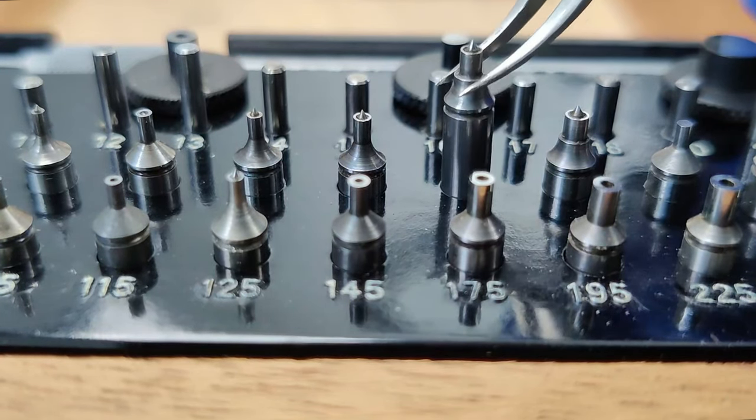Twisting the handle on the other end of the spindle draws the collet in, securing it in place. And now I'll swap the previous spindle with this reaming spindle. And we'll slide the reamer through the hole that we want to ream and begin turning it while at the same time applying downward pressure. And once the reamer slides through the hole, it'll be sized to our desired diameter of 2.29 millimeters. Because the outside diameter of the new jewel is 2.3 millimeters, and this slight 1/100th of a millimeter difference allows the new jewel to be held in place by friction.